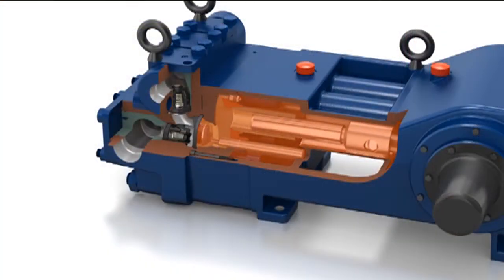Depending on whether you're pumping sour fluid, the fluid will contact the inside of the diaphragm. When considering what you're pumping, we would choose the right diaphragm or the right fluid head material. This one is nickel aluminum bronze; we also make it in 316 stainless for slightly sour applications.